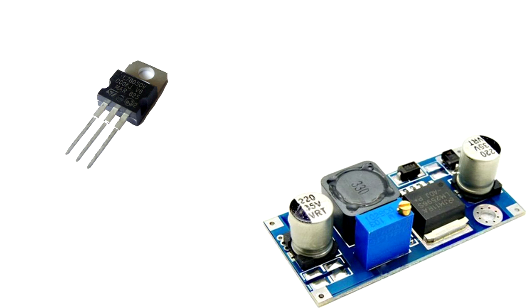Well, there's a couple of different options you can take there. You can use that chip, which is a traditional analog voltage regulator. You know, they've been around for a number of years now. The one on the left there, very simple to connect. You just need that and a couple of capacitors, and you're good to go. The other one looks very familiar. This one is an LM2596. That's an adjustable voltage regulator on the right-hand side there. That's one of the newer devices that you can get now.